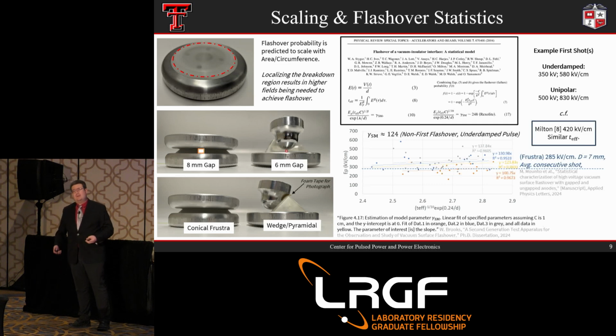across here, but by the time that the system was developed and devised, the measurements we were taking were for bipolar flashover, so the voltage would swing very positive and then swing very negative and then oscillate back and forth. And to the best of our understanding, this ended up biasing the insulators in such a way that the overall performance was significantly degraded relative to a unipolar configuration, which is what is technically relevant to a machine like Z or Saturn. In fact, if we compare the two, what we end up finding is the parameter is almost exactly half in terms of the characteristic model.